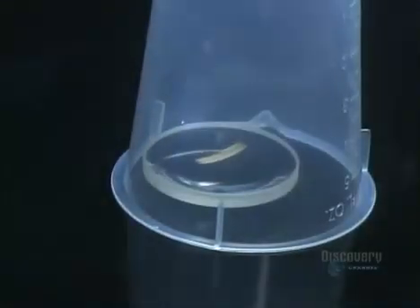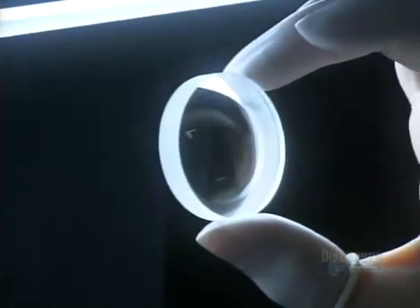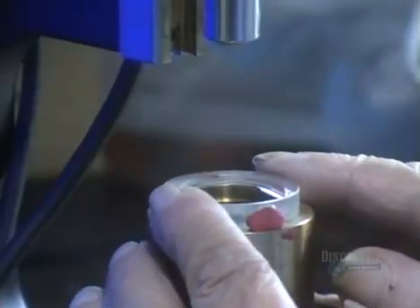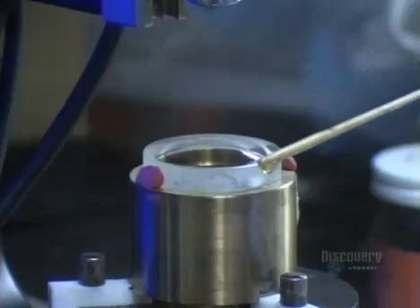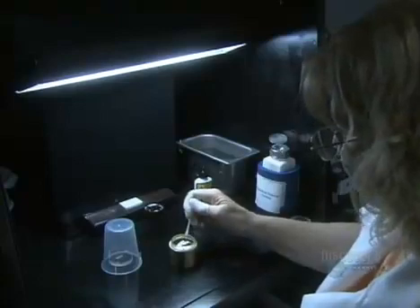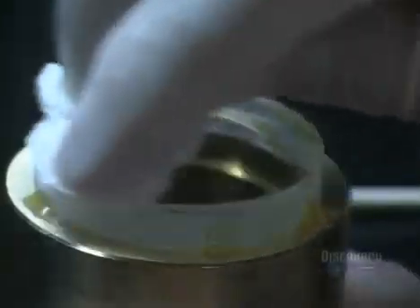This particular lens is concave. She covers it to protect it while she cleans and inspects the lens with the opposite profile — convex. Then the convex lens goes to another technician who places it in a holding device. He looks into a microscope and adjusts the position of the lens until it's optically centered, using wax to keep the lens from shifting. Each lens must be absolutely spotless before proceeding to the next step, as dust particles could become trapped within the optical system and affect image quality.